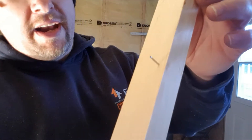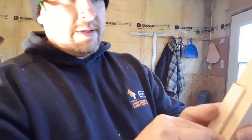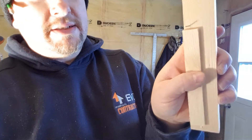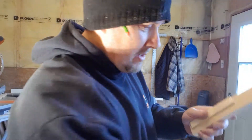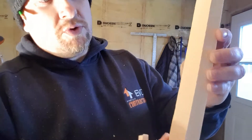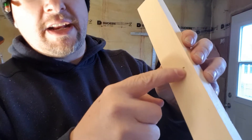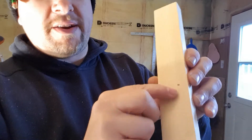Here's the piece again — you can see the nail, no dents, nice and flush on the back with just a single nail hole. Take my scrap piece, put it under the nail. It works a lot better when you have it laid down on the bench. Put the pliers on the nail and pry — out the nail comes. You're gonna have maybe a tiny spot there, but at least you're not putting dents that are gonna be visible on your plaque. You only have the single nail indent on the back instead of hammering the nail back and causing the wood to chip, gouge, or splinter. Then you can just re-nail it back onto the frame. Quick tip — hopefully it helps somebody out there. Have a good day guys.